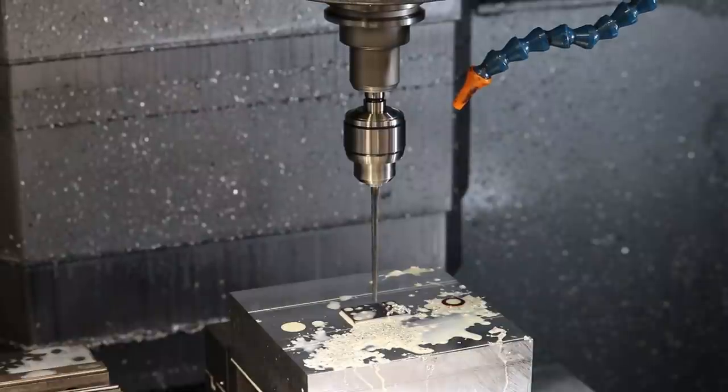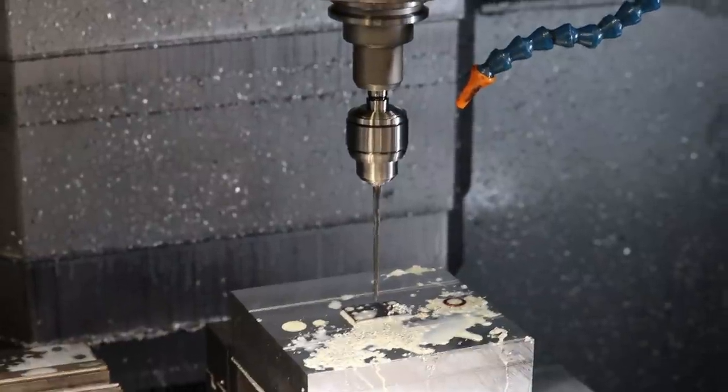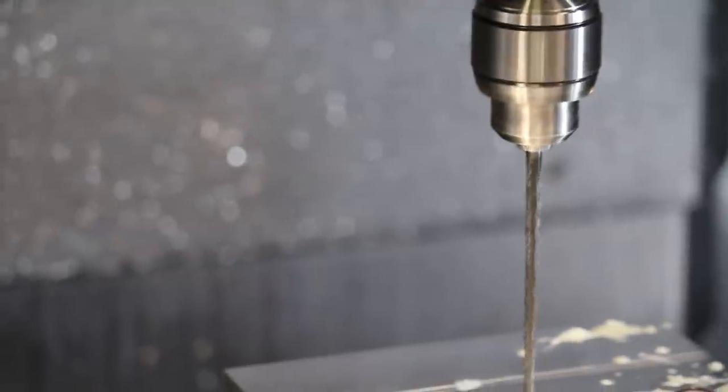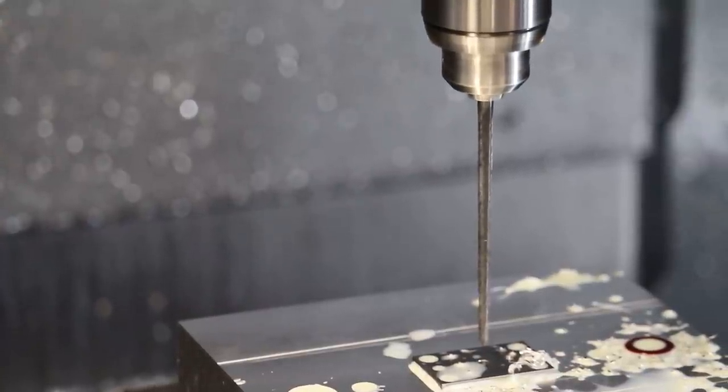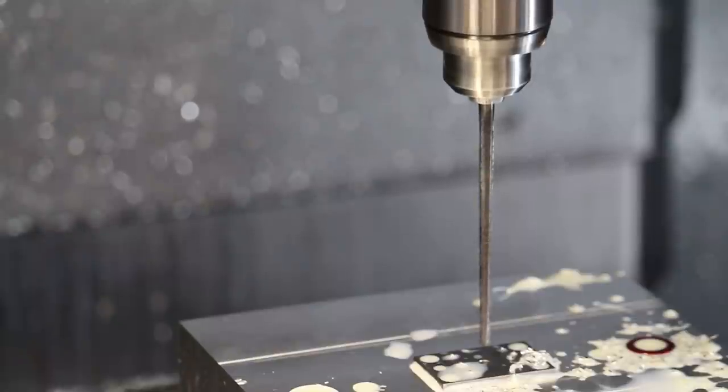The trick with drilling this tapered drill, at least that I've discovered, is that the drill peck, which is the amount of material you remove per cycle of pecking, is only about 75 microns or 3/1000ths of an inch, which doesn't seem like a whole lot at the beginning, and it seems to take forever because it's just slowly pecking. But as the drill gets deeper and the entire tapered face of the drill is cutting all at once, by only cutting about 3/1000ths per peck and then clearing out the material, you save the drill so that it doesn't twist off and break in the chuck, ideally, unless the drill starts to get old. So this will take a while, maybe 20 minutes or so. So we'll do a little bit of time lapse of this operation.